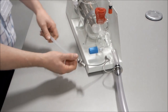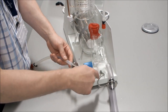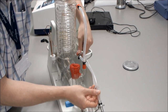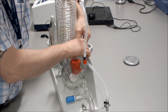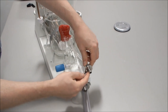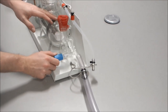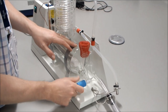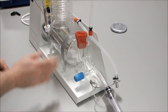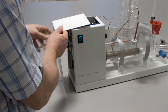Connect the cold water inlet tube. The 8mm earth spigot is connected with the other earth spigot to an earth point. Connect that to the bottom connector of the condenser — this is where you connect your cold water supply. Ensure the stopcock on the front is fully closed, then refit the end panel.